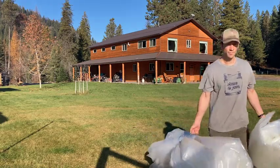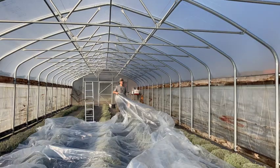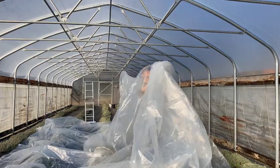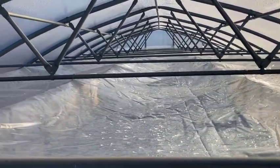Inside your greenhouse there's a lot of space that you don't need to heat. What we're going to do is work off the bottom of these trusses, since it's a nice flat surface, and we're going to install a sheet of plastic using some baling twine. That's going to do a couple of things for us. One, it's going to decrease the amount of space that we need to physically heat on top of our plants, but also it's going to create an airspace between the sheet of plastic and the roof itself, which is also just a thin sheet of plastic. That's going to create a dead airspace, and air is a fantastic insulator, and that's going to minimize the amount of heat that we're losing through the roof, which as heat rises, that's where it wants to go anyways.